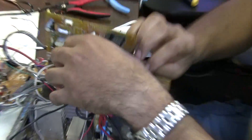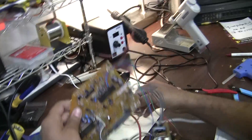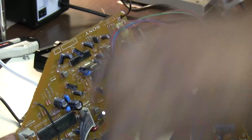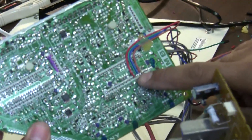Those are two or three tiny little pads. This is the actual input card right here. What I did is pull the jungle chip pins out of circuit. The brown wire is my blanking signal. The other ones are self-explanatory — you get your blue, your green, and your red going in. Those will be in the middle, connecting to the common point of the 4PDT switch. Right here is your original OSD signal — I tapped into the actual pads. Remember how I lifted those pins? The original signal is still going to those pads, and this will be on the other side of the switch.